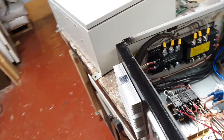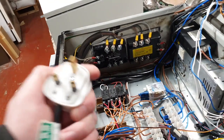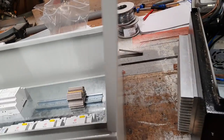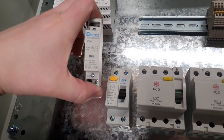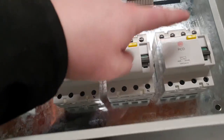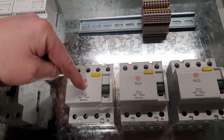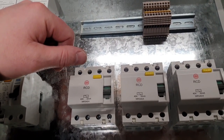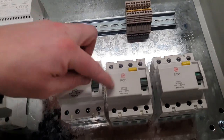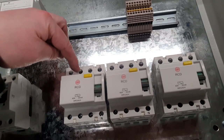I'm going to continue to do that, because that means we can take the panel down independently, and we know that if we've isolated all of the three-phase stuff and we unplug this plug, then the system is dead. And we're going to be replacing things like that with a 20-amp contactor here with an RCD, so that's going to protect the control electrics. And we've got three RCDs here which are going to be protecting the elements, and they have at the other end of these cables in the control panel 25-amp MCBs on each one.